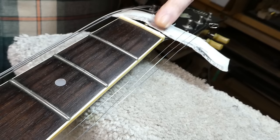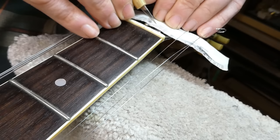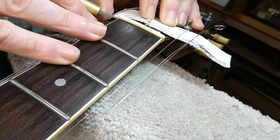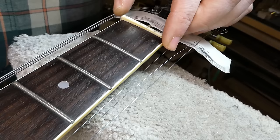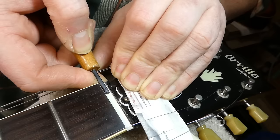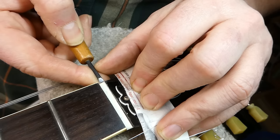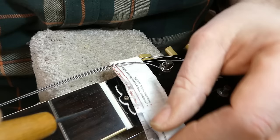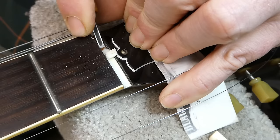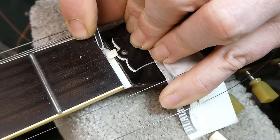Glued into the back — it could pop a bunch of lacquer off, or even damage the face veneer of the headstock. I'll go along and put the knife in the seam between the shim and the nut. I don't know what that material is — it may be plastic. Actually, I think that might be one of those bone shims Stewart-MacDonald started selling some time ago. And it's well and truly glued in place with a lot of super glue.